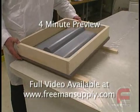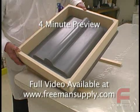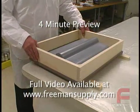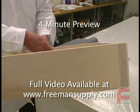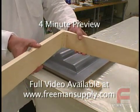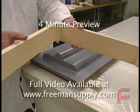This frame gives us an ending point for our tool, unlike an actual part where we would want to extend the laminate beyond the desired dimensions and then trim it later. The frame is as large as possible in order to maximize the flange, or flat part, around the model, which will be useful later when forming the part. We drew a line around the inside of the frame to provide an ending point for our resins. We don't want the laminate to protrude above the support frame, as this would require unnecessary trimming to create a flat back surface.